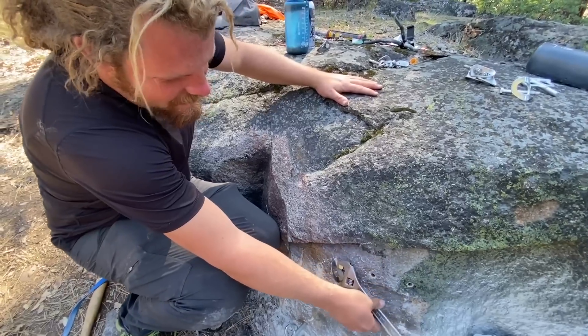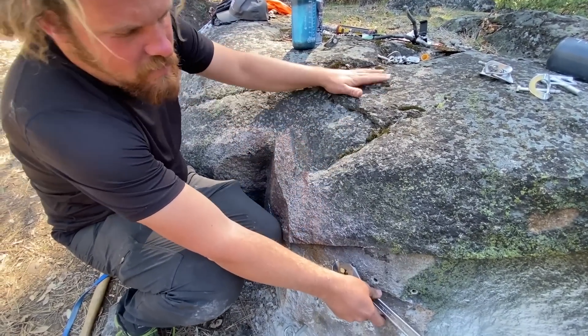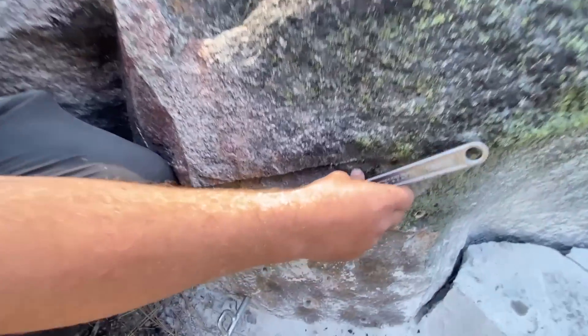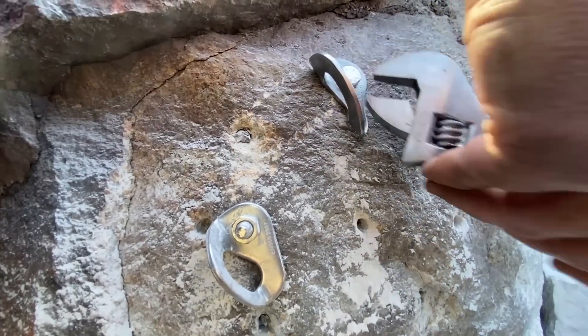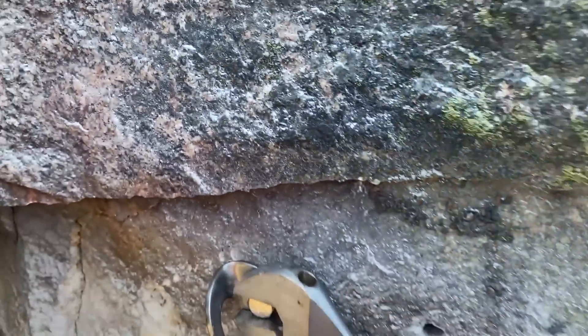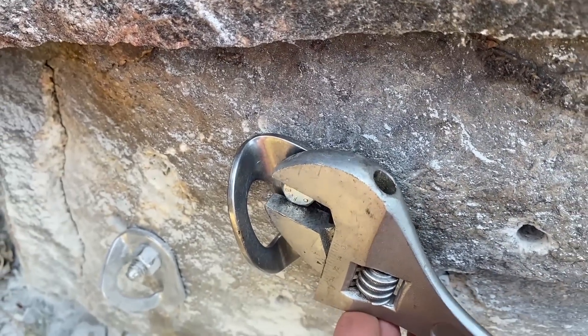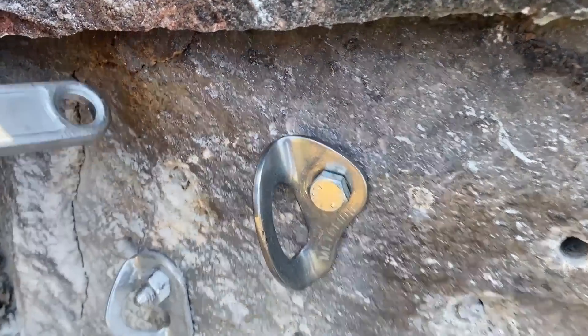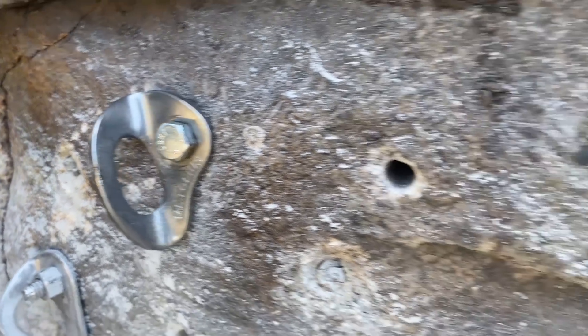How's it going, Bobby? I'm noticing that I'm not really hitting tight. They just keep turning and they're not getting any tighter. I would say that's less than 10 foot-pounds that I'm putting on there — hand pounds. I'm going to stop because I'm worried about totally stripping these bolts out. Let's see if the next hole engages better.